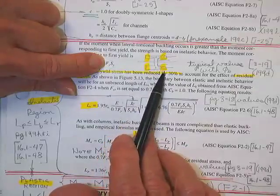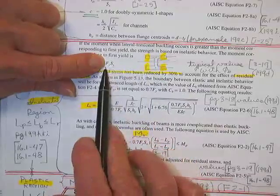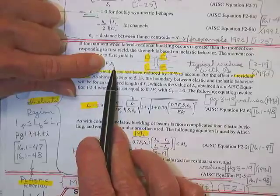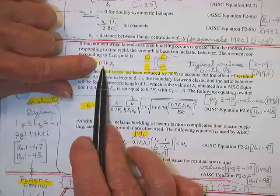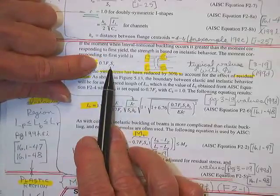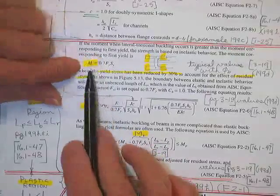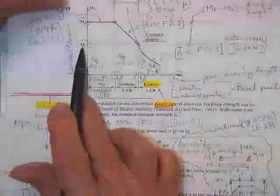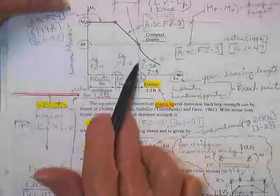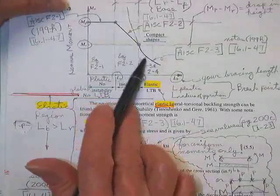So that when you bend it, it's at the worst place, too, on the outside fibers. When you bend the beam, you really don't get F sub Y, S sub X at yield. What you really get is about 7/10 of that. They find that by test. So we can't hardly call this M yield because that's M yield. So they call it M sub R. It corresponds to the point where L sub R occurred, where the radius of gyration was causing problems and causing this curve not to be correct anymore.